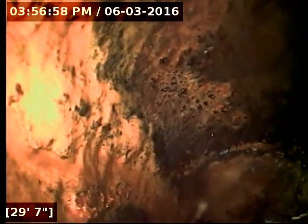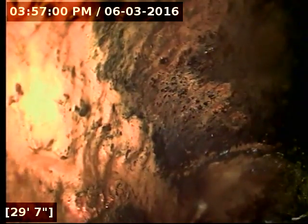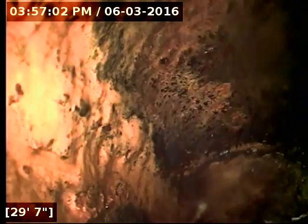Alright, I went ahead and located here also here in the yard. The locator signal is not coming in terribly strong and accurate here. It's kind of bouncing around a little bit, and that might be because of the depth plus cast iron pipe impeding the signal. I pull back here just prior to the roots so I can straighten out the camera to get a better locate. So where my marking is at, it's just about maybe 6 inches or a foot beyond that marking. But because it's bouncy, I just think it's a good idea that the repair company throw a camera or a locator in the line just to double check the markings and the depths and everything.